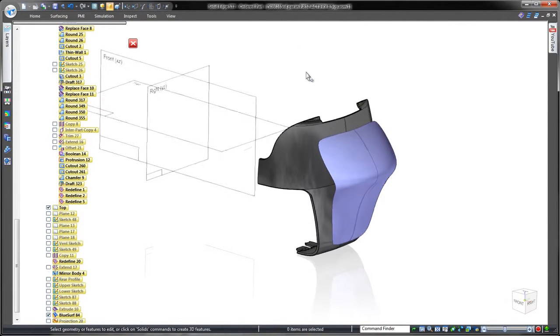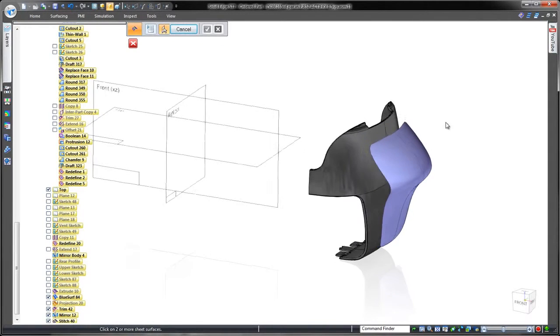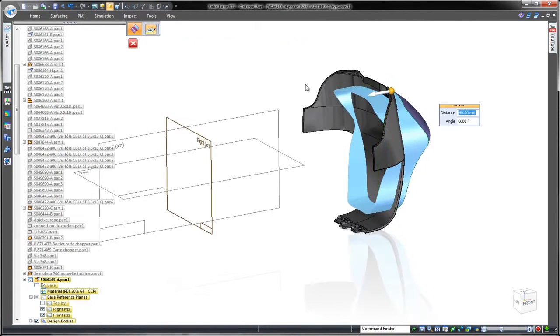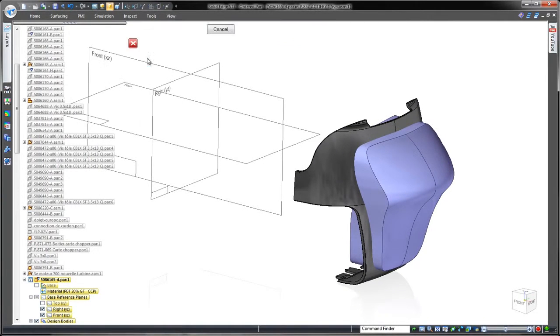To complete this rear surface, we'll stitch together the two halves. The ruled surface command extends the edges through the existing casing part. Advanced rounding really aids aesthetics, so we'll place a constant width round along the edges.